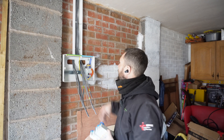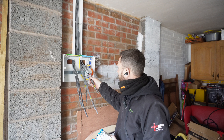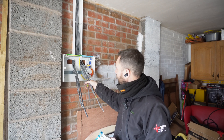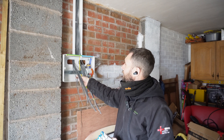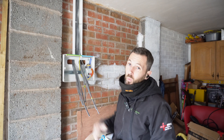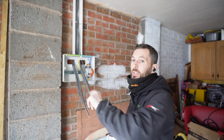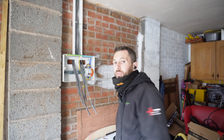They're all going to be put in now. We've got the living room ring, the kitchen, dining room ring, and the upstairs ring. We've got an oven and a hob, we've got an immersion heater, upstairs lights, downstairs lights, and we're also going to be putting two garage circuits on here as well — garage lights and a socket below. A bit of trunking on there, nice and sorted, run it over to the other end, socket mounted underneath, and that's all he wants for now.